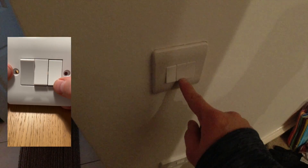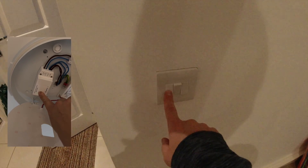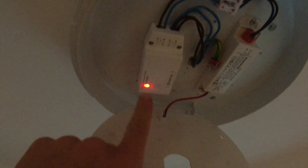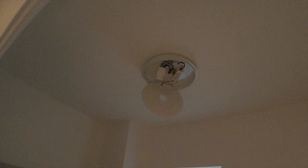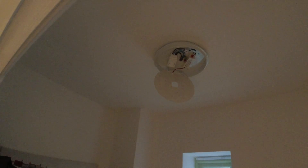There we go - I've got the power back on. Two-way working downstairs, two-way working upstairs. There's the new kinetic switch. Let me show you how easy it is to pair it up. We're all connected and powered up. Hold the switch for three to five seconds - you get a little flashing red light. Then click it - you get a solid light, and that's now programmed up with the receiver. When I click that again, it will switch that light on. Easy as that.